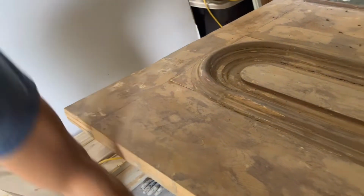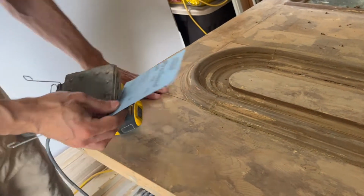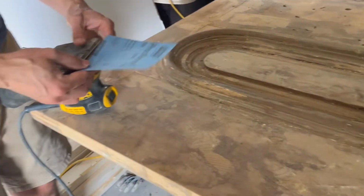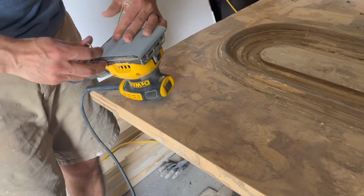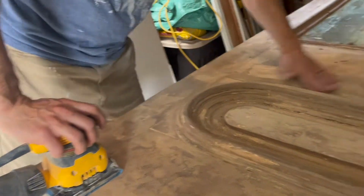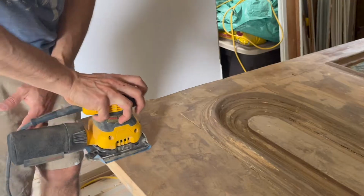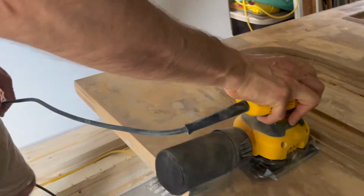At this point, you might find some raised bits or some paint remaining on the surface. You can definitely reapply the paint remover and do the last few steps all over again. That's certainly a great way to do this, or you can try to sand down the bits. Again, if you're worried about lead paint, using the paint remover process is a much safer way of doing it.